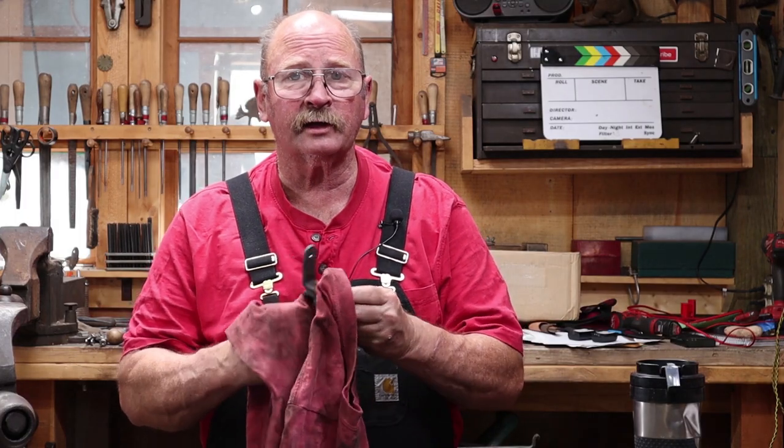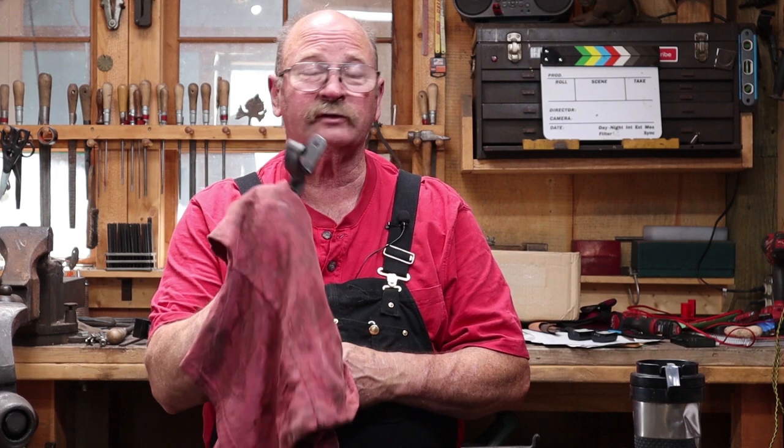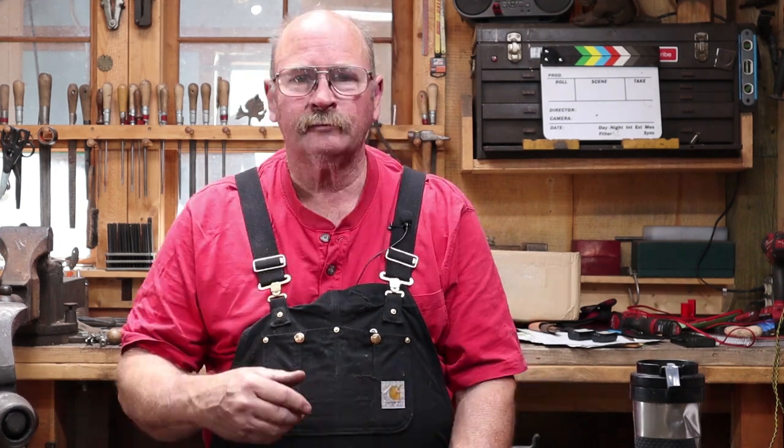With a little bit of paste wax on it, this hook is complete, but still too hot to touch. Sometimes just having the ability to do that little simple forge weld can really open up some doors for you. So if you haven't learned to forge weld, this is a good project to try. It doesn't have to be a perfect weld — you don't have to bring two pieces together, it's just folded over and welded. Good basic weld if you're just learning to forge weld.